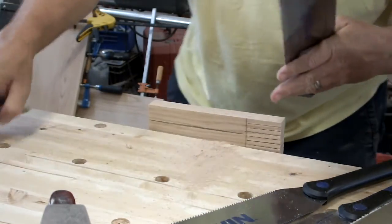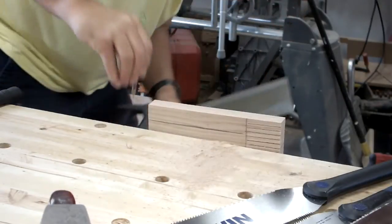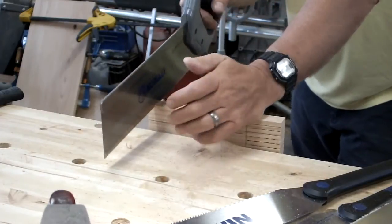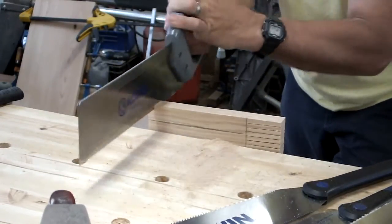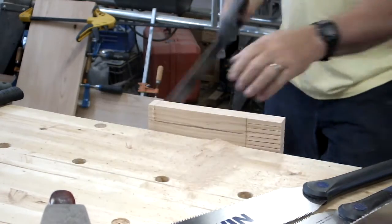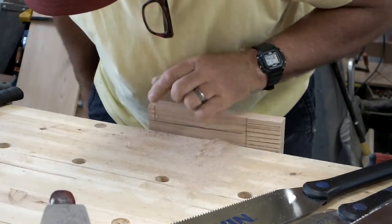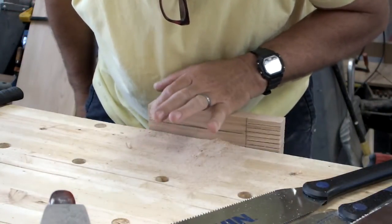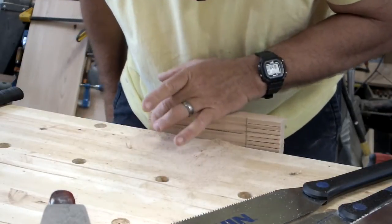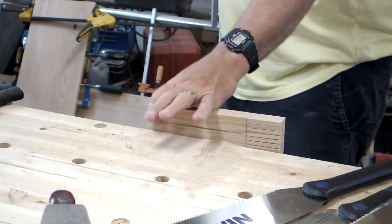I'll go to the line. I'll put it on my side too. Good rough idea here. Now, starter cut. Okay. 1, 2, 3, 4, 5, 6 is to my line on the back here. Some fair amount of tear out, but I still don't think, in practical working terms, that's going to hurt anything. Most of the time I'd have knife lines, a knife wall. Probably not going to hurt anything.